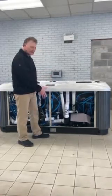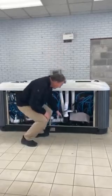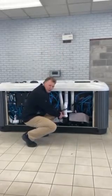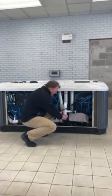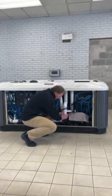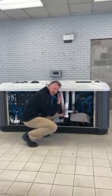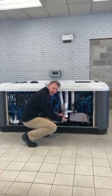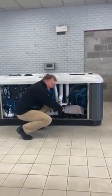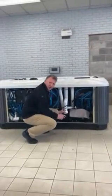What you need to do is remove a panel, go to the hum — the motor that you hear humming. We want to go to the top union. At this union, we want to crack it open. It takes a little bit of pressure and you'll have to just move it open. When you do that, you'll hear a little whisk of air coming out. You'll want to let all the air come out until you actually feel a little drizzle of water.